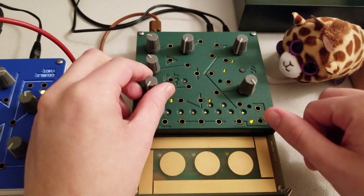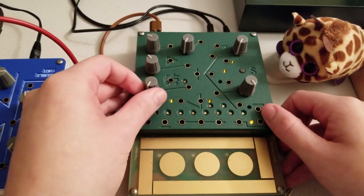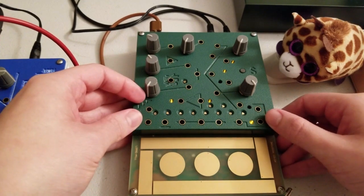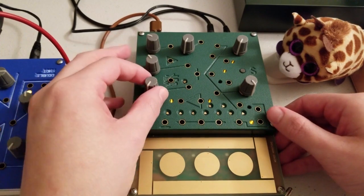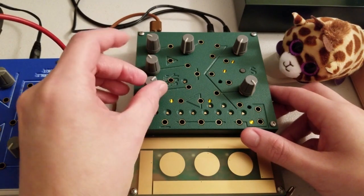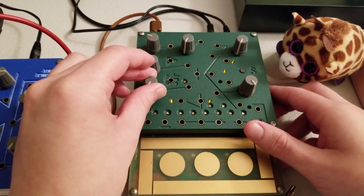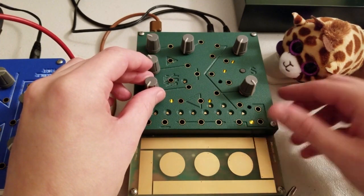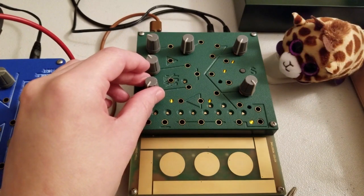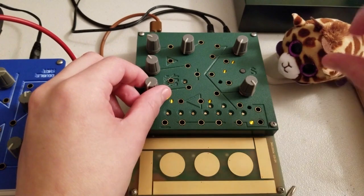I looked at this under a spectrogram, by the way, and part of what gives this such a distinctive sound is that the wavefolder heavily emphasizes the seventh harmonic in the harmonic series, which is kind of unusual for a wave folder. I did some research on the Lockhart wave folder, by the way, and apparently it was originally invented to take a sawtooth and move it up a fifth, I think. It doesn't work at all, apparently, for its original purpose, but it sounds neat.